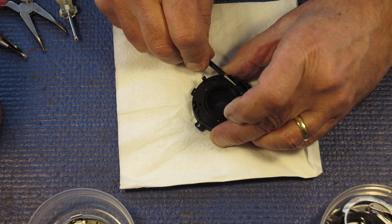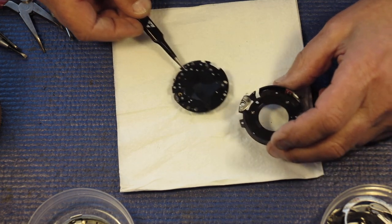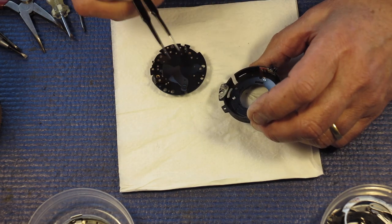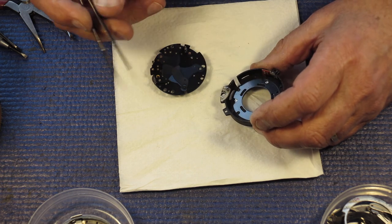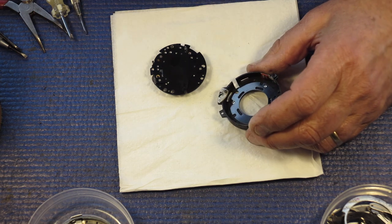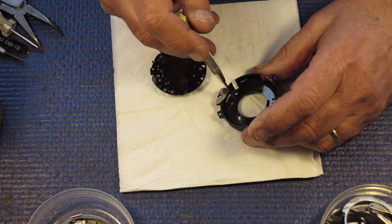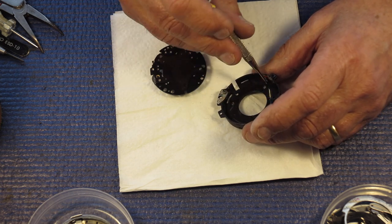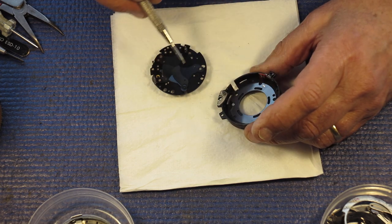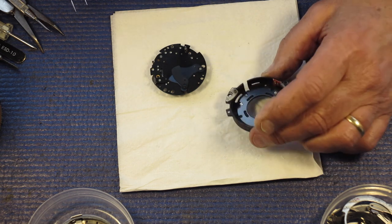Now we're going to split the case. There's the outer case — there's not an awful lot in it, just a flat plate here. If the shutter had been somewhat different there might have been a diaphragm under there, but the diaphragm in these cameras is in the lens instead. Not much to do here apart from make sure this is very clean before reassembly. I always check those screws to make sure they haven't backed out at all — if they were loose they could back out, catch a shutter blade, and stop the whole thing from working.